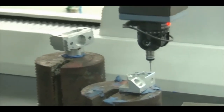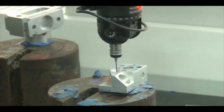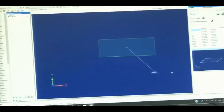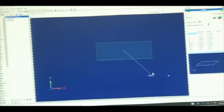We touch the surface at three points — point 1, 2, and 3. Three points are now recorded in the software. The software displays the defined plane. This is Plane 1, now defined. We can name the plane — for example X-Y plane — or use any preferred name. Since we did not change the default name, it is labeled Plane 1.